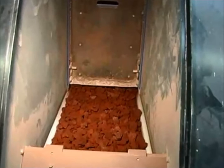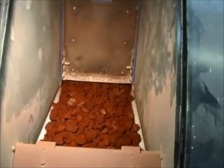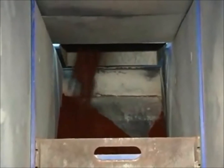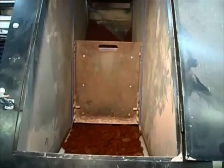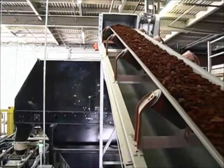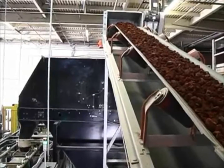Product level is maintained at an optimum level with the adjustable rock gate. Product bed depth is adjustable by manually moving the rock gate up or down. The rock gate provides outstanding product bed depth control for a variety of aggregate products, from lava rock to pea gravel, as well as wet and dry sands. Controls for in-feed devices such as trough conveyors, live bottom feeders, or gravity feeders are included in every 300VF.